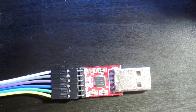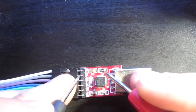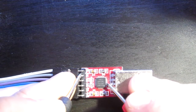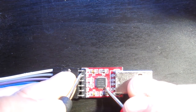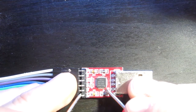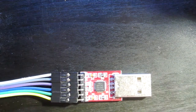First I want to make sure that the pin is actually floating, so we don't short anything. So here's ground, and here should be a ground pin, like this. And the pin that we want to solder — it's not connected to ground, it's not connected to the voltage rail or anything, so it should be okay.